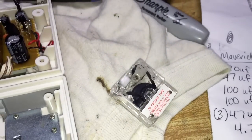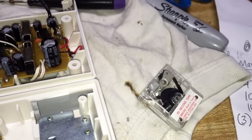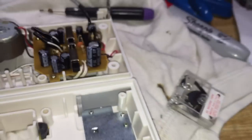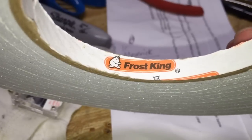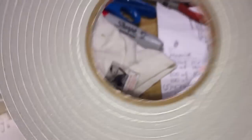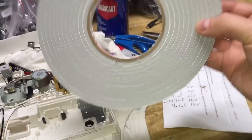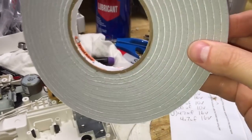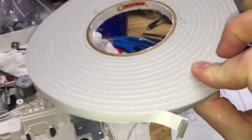I'll demonstrate that for you here in a moment. As for the pressure pad — what did I use for that? I bought some Frost King weatherizing strip, a roll of weatherizing strip for your house, for a window or a door. It's self-adhesive. All I did was cut a little bit off that roll, and I've got a ridiculous amount of extra padding that I can use for 8-track tapes, cassette tapes, or other old tapes that have a deteriorated pressure pad.